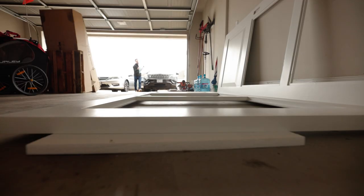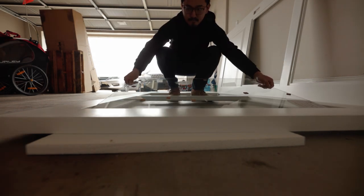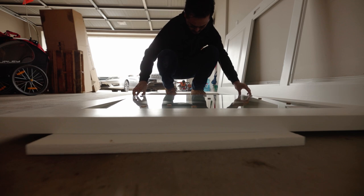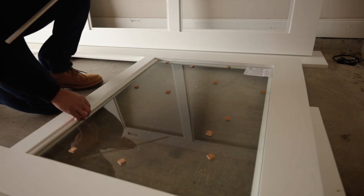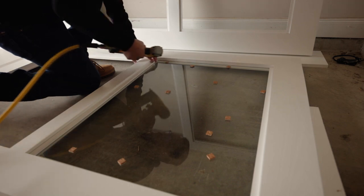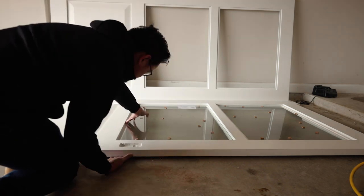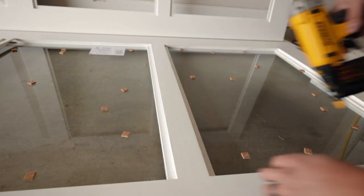The following day was install day, and the install actually took a lot longer than I anticipated. I installed the glass at the client's house since I didn't want to transport the door with the glass installed and risk it breaking during transport. The glass is held in place with wood trim and a bit of silicone to keep it snug but still allow for some wood movement. The benefit of installing the glass this way is it's easier to replace later if the glass ever breaks — all that's needed is to clear the trim, remove the broken glass, replace the new panel, and then reinstall the trim.